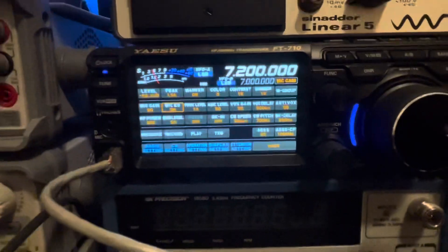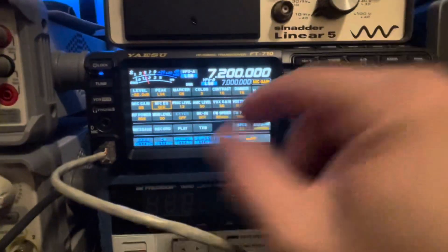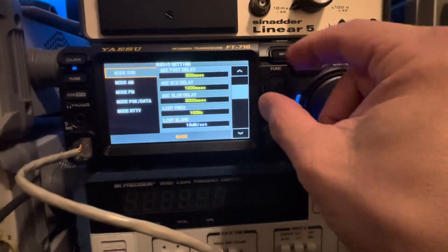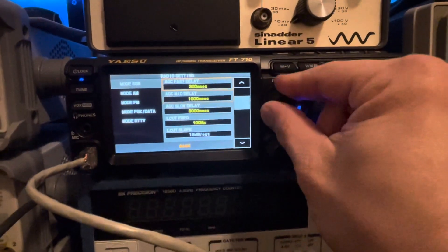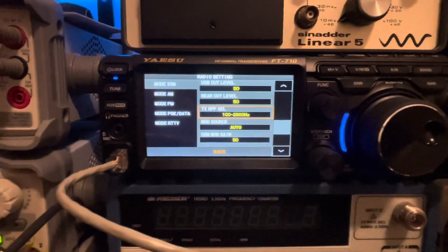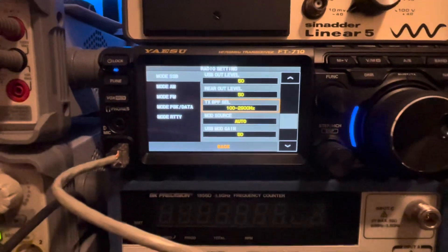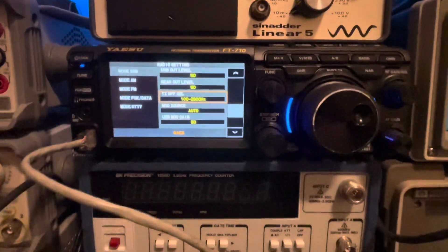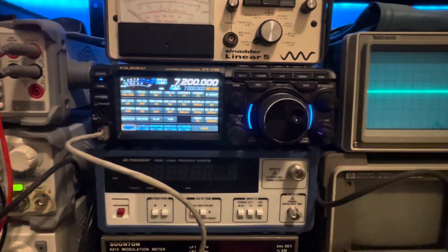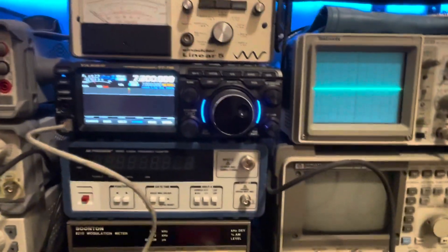AMC level is 50. I've also done a bit more experimentation with the radio settings. Going down to the bandpass filter setting, I have it at the default 100 to 2900 Hz, and it actually works best there — we get the best linearity with it right at the default.